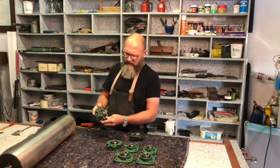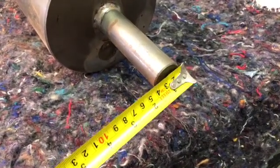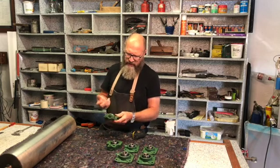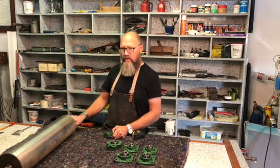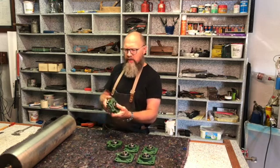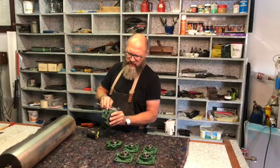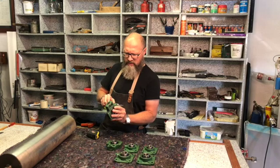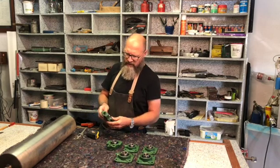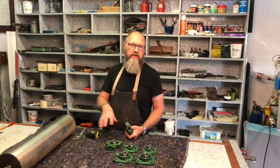It's all about the size of your spindle. This spindle here is 30 millimeters in diameter, so I had to get bearings that are 30 millimeters. You have to work with what is available — don't buy all your materials before you're sure what bearings you can get. This bearing is a sliding bearing and it's got a groove here, so it's also important to know that measurement — in this case it's 12 millimeters.